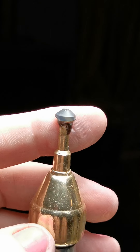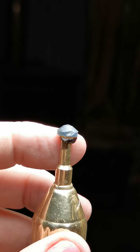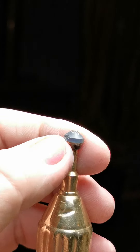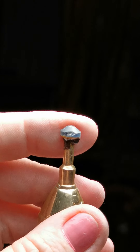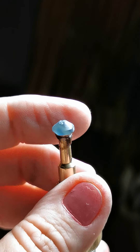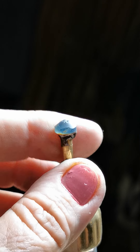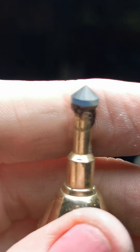I've just started rounding the gem and coning it to bring it up to a culet. We've still got a fair way to go so the diameter is going to be brought in quite a bit. I may have to move it slightly over towards this chip here, which we do by reheating and pushing the stone over a little. At this stage you can look to make sure there are no unseen flaws and get an idea of your color zoning — there's a yellow color zone coming in with the blue over the top. I think we will get blue into the culet of this stone, which is really what I want.